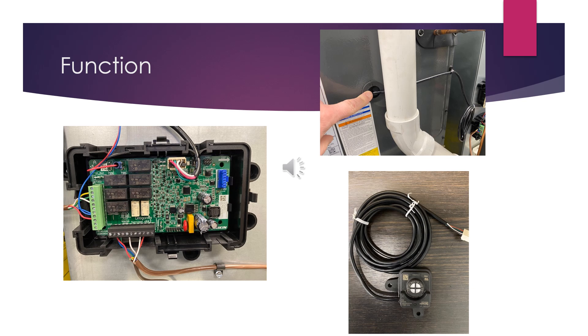As you can see in the photos here, this control will mount near your HVAC equipment. It will come with a 4-pin connector to adapt to a communicating system and it has two electrical connectors on it. The black electrical connector at the bottom will go to all of our accessories, controls, and the system — such as our condensing unit and our thermostat. The green connector on the left is what connects to our HVAC equipment.